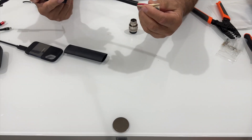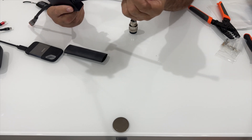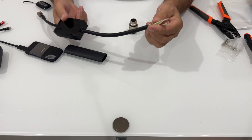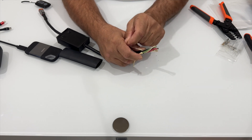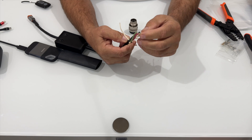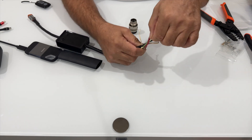The first thing you're going to notice is I trimmed the ends off nice and clean, and I've stripped the insulation back about an inch and a half. There are little pieces of paper — sometimes you see string — and you want to get those out of the way, so I just pull them back. Now I've got my four wires left.